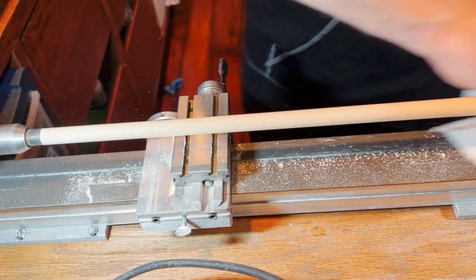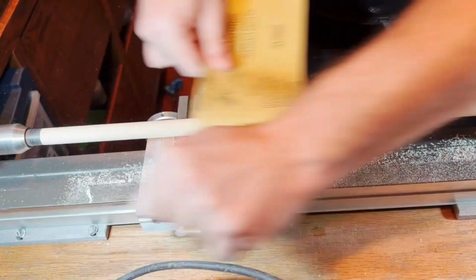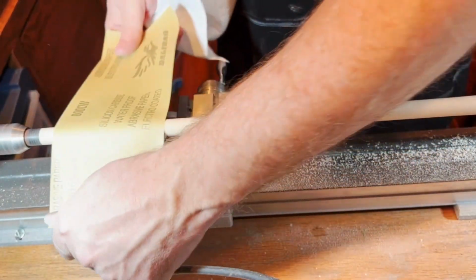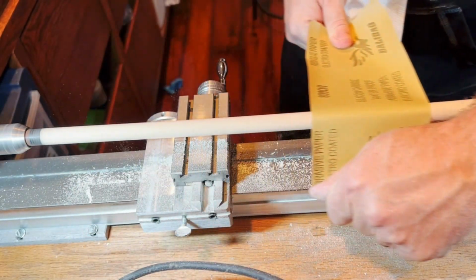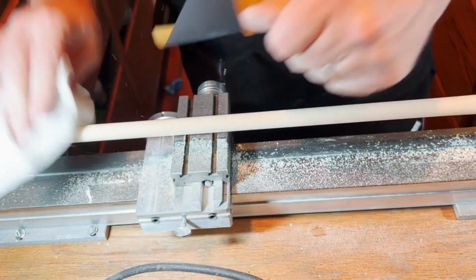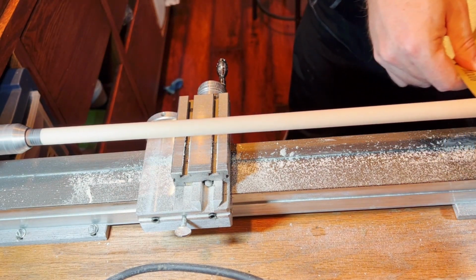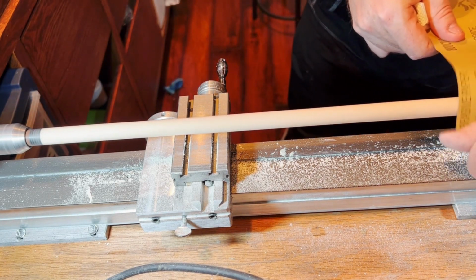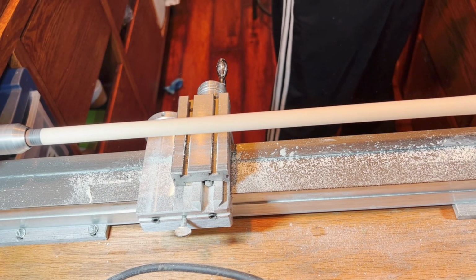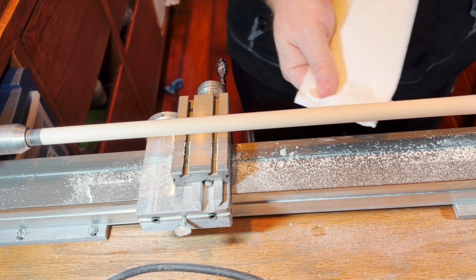Wipe down between. Get a feel. Any high spots? There's some in there. Just gonna hit that area again. 800. It's getting smooth. I'm going to use half of this because I'm going to use the other half. Always want clean paper. Use the other half, take off, seal it. So 800 on the seal. Just want to see it wet.